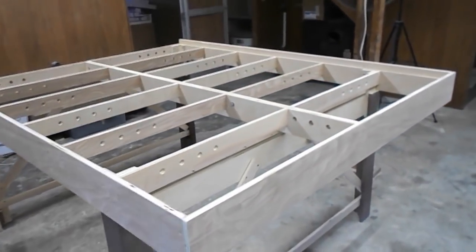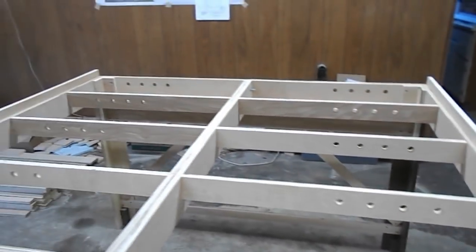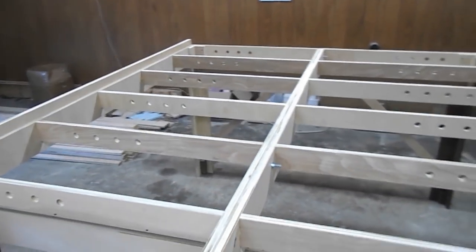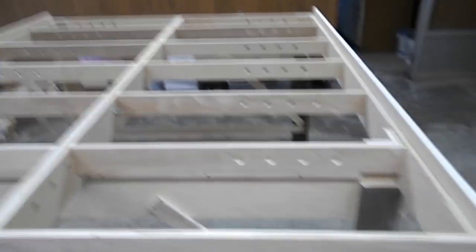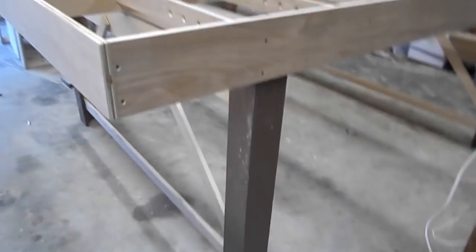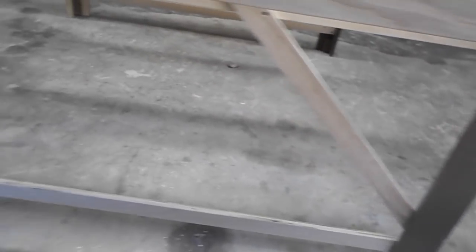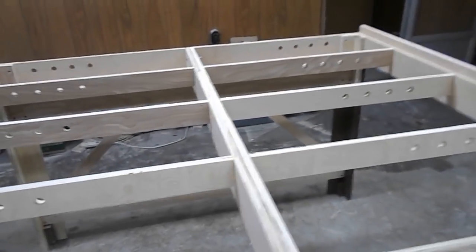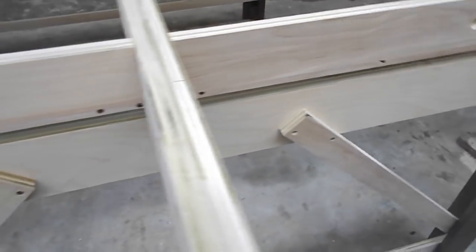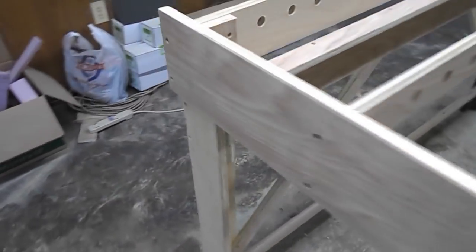This is how far I've got on the other project — just a small addition to an existing railroad. This section holds a three-track return loop and a Y, just for turning the trains. They wanted me to use their version of legs here: L-shaped legs. They gave me some old ones and I had to modify them to fit because they were too long. I've added bracing so they're actually a lot more rigid now. Since this section is too wide to go in the van, it's got to be split down the middle — it's two 33-inch wide sections, with bearers between the legs to hold up the middle, which makes it structurally sound.